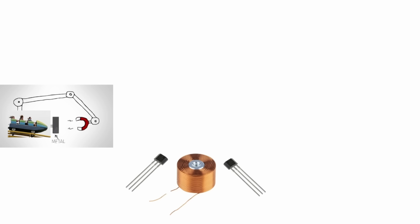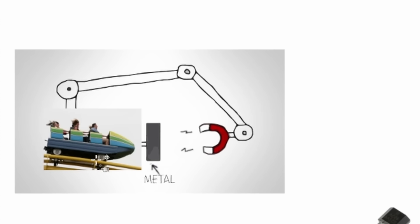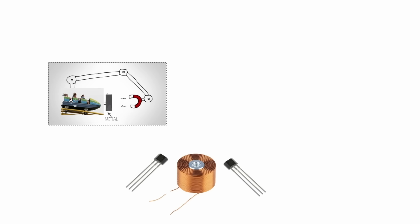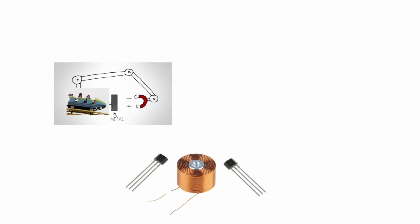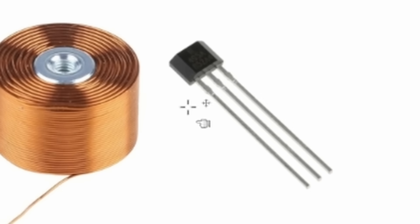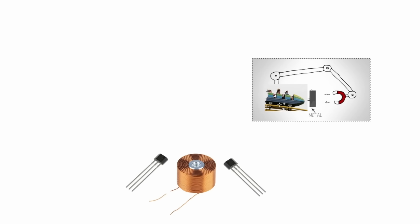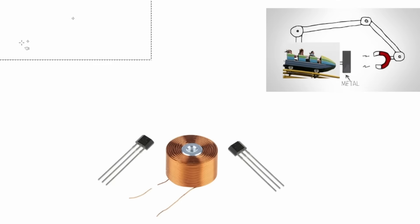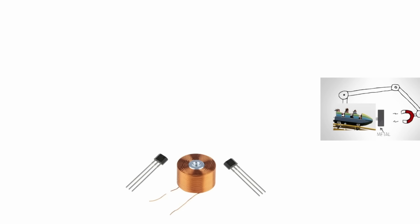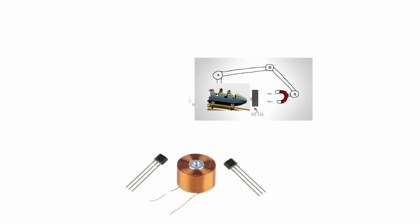I haven't really explained what's going on underneath the hood. We basically have a car with a magnet underneath it, two magnet sensors, and a coil in the middle. When the car passes over the first magnet sensor, it tells the coil to start pulling everything towards it — the car goes in and overshoots just a little bit. That's just enough to trigger the other magnet sensor, which tells the magnet to now push. So the car goes along its merry way: we pull, pull, pull, and then we push, push away. If there are two cars, we start pulling again and then pushing again.